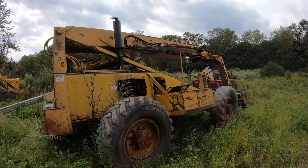So what started as a disaster may actually end up helping me to diagnose the rest of the problem with this machine, which I was going to work with the low power issue for now because I figured it needed new rings and probably new sleeves in it, but I didn't want to do that until my house is done being built. But if I just need to replace these seals on the injectors, then I can do that now and maybe I'll get my power back.